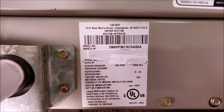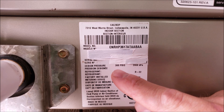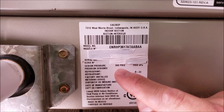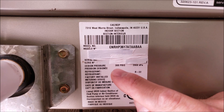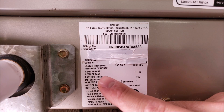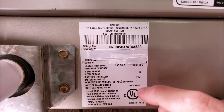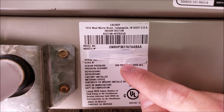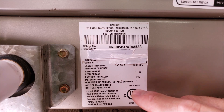That's if the system was new. This R22 system is older — the date is 2007. This coil is fairly old and the copper could be corroded, so we don't want to create a leak when pressure testing. Since this is an older system, we may only want to pressure test the line set and the evaporator coil to maybe only 100 to 150 PSIG. The refrigerant for this evaporator coil is R22, and that's why we have a lower design pressure. I've seen some design pressures as low as 150 on older R22 coils.